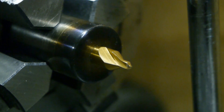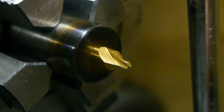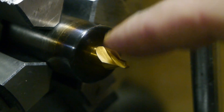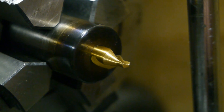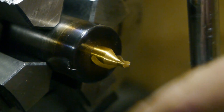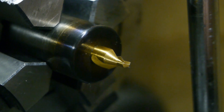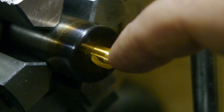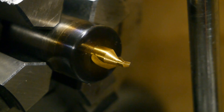The original idea was to put in a set screw, but that will only push the center drill to one side causing more run-out. So now I'm thinking maybe I can cut a slit, maybe two centimeters deep, and then clamp it down — that might work. For now I've had enough of this project, so I'll keep using my small drill chuck for a while longer.